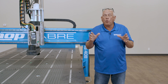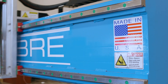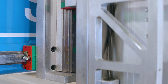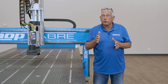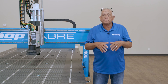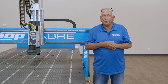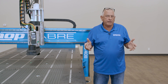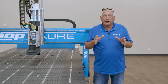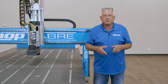Linear guide rail technology is really the first part of machine motion. Precision contour linear guide rails are used on all axes on the IS series CNC's. We start by machining the datums where the rails mount in our milling phase, which assures that the rails mount perfectly straight onto the frames. Then we add the 25 millimeter precision contour linear guide rails for each axis — this is an area where competitors may cut corners. We use quad roller linear bearings on each axis to make sure loads are adequately transferred as the machine accelerates and decelerates. The end result is smooth motion, high accuracy, and less maintenance.